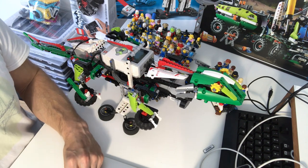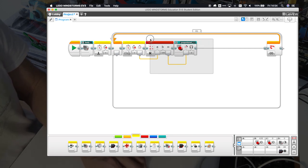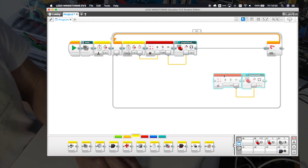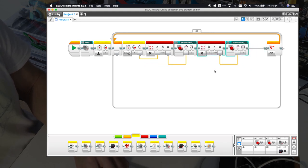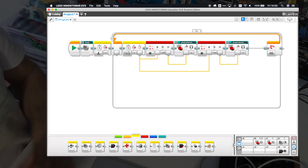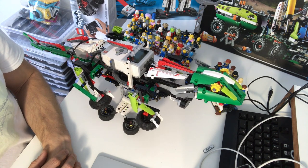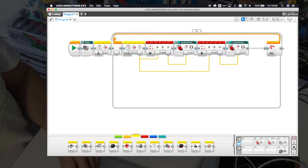Let's call this one 'position' and that one 'port' — both inputs, both numbers. You can wire ports into blocks, so let's put the port into wired mode and connect to the port parameter. Close this and go back to our main program, click to clean it up. Port B is port 2 — let's see if the program still works after making the My Block. Yes, it still works. The next thing is to do exactly the same for the back legs, which are in port C, which is 3 for the port.